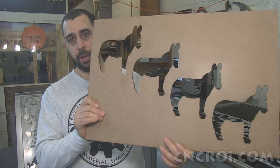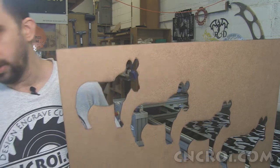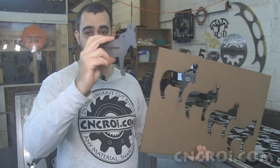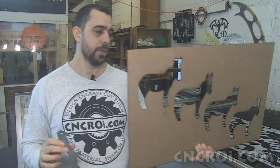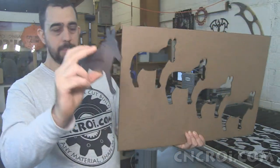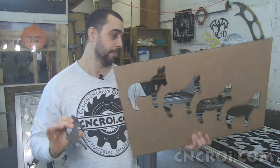So here's the jig that I used for the fiber etching. So this here fits right inside of here. And the reason I did that is because I have almost 70 of these to do, and I don't want to have to use my brain to organize all of them properly in the right position. So I have a program cut this out on the laser. And then this fits perfectly inside. So my X and Y, all the placement is dead on perfect.